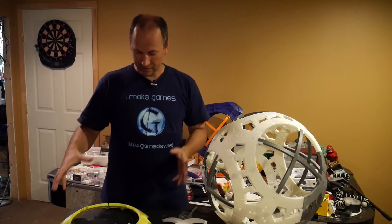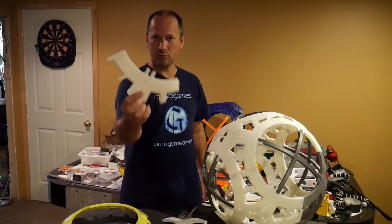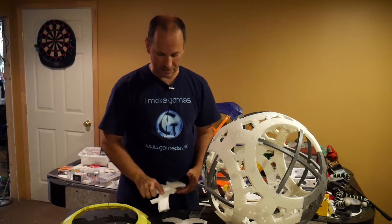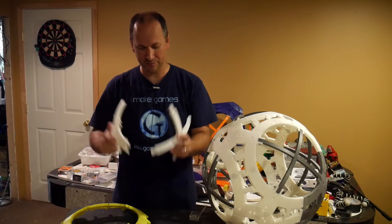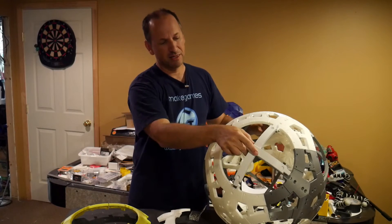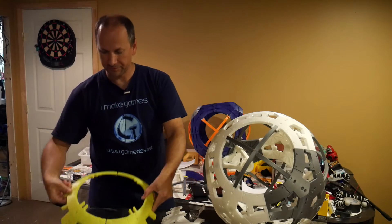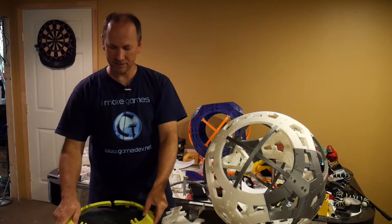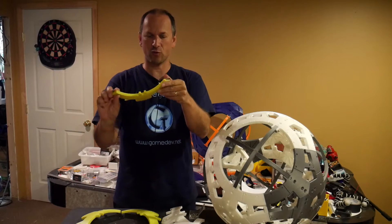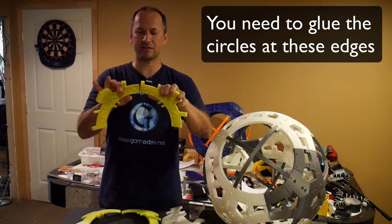This design is made of basically repeating segments — you print one piece 24 times. Then there are cross ribs: six pairs that go across the circles. These are my lightweight versions. The segments form the cross piece, and they assemble into rings. In between the rings there's either an aluminum washer or a penny — aluminum washers are a bit lighter — and they form a nice spline for a much tighter joint.